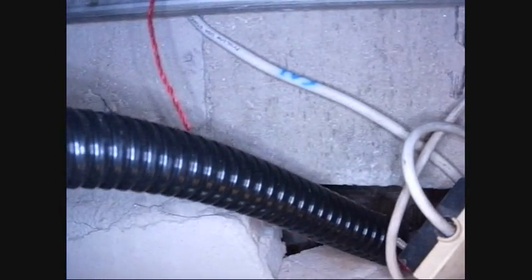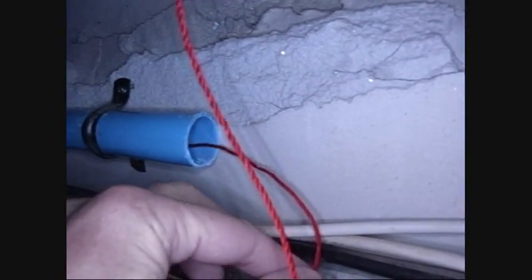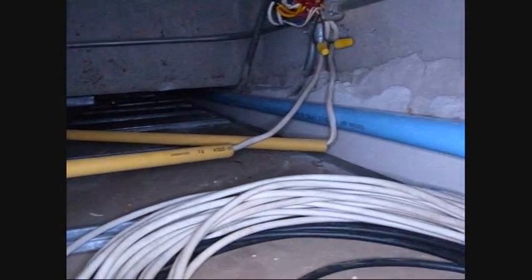From there, we'll go through this piece of flex. The flex will go down inside the wall, and the flex is to keep the fiber from coming in contact with the rough cement or any sharp edges. Then I'm going to cement this back up. There's another red string — the red string will be used to pull the fiber down the wall, and out the hole we saw earlier. That pipe runs along here, and out above the sheetrock gypsum, right about there.